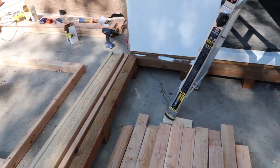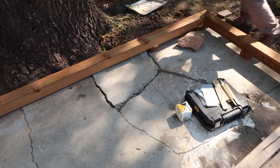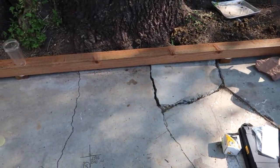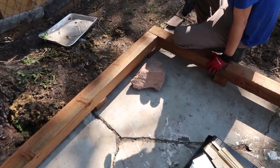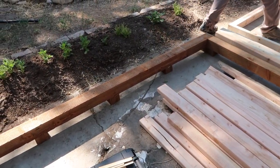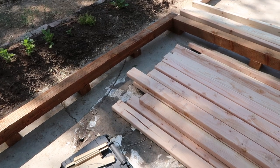The first thing we did was figure out the dimensions of this space. We already had a concrete pad here but it was broken from when we cut down a tree a few months ago. It's still going to work because we used shims underneath the 4x4 and liquid construction nails, and Josh is going to screw all the pieces together so it's really sturdy and strong. To cover the gaps and prevent predators we're going to use a 2x6 on the exterior, and we're also going to have hardware cloth that goes all the way down.